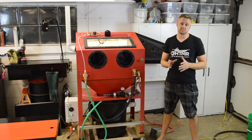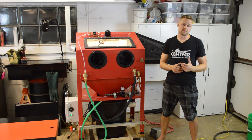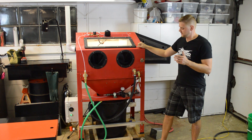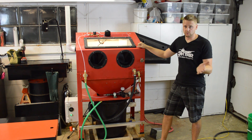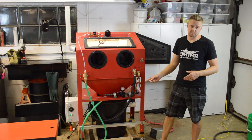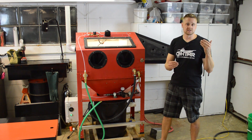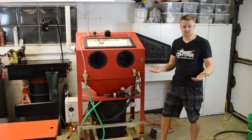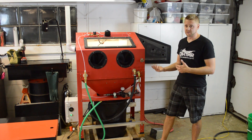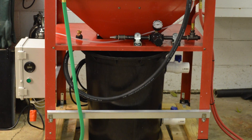At the time of this video, there are no DIY plans out there. I searched hard and found very little information on how to build one of these, so these plans are complete and give you all the info you need to make this thing work really well. Let's back up and discuss what vapor blasting actually is. The term is a little misleading — there's no actual vapor in the system. What I have is a reservoir full of water and abrasive media. An electric pump agitates the mixture into a slurry and pumps it up to the blast gun. Air is introduced and blasting occurs, just like dry blasting, except it's wet — resulting in a really desirable finish for restoring aluminum parts. The pump I'm using is proven for this application and used in the industry, so it's going to be reliable.